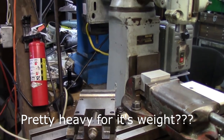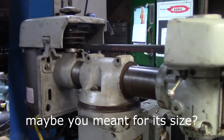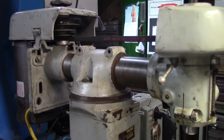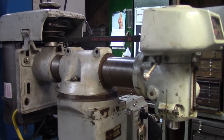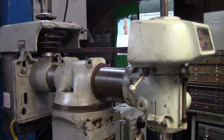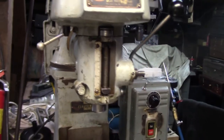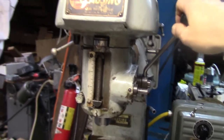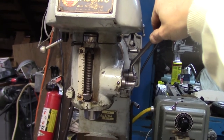It's pretty heavy for its size — this machine weighs about 700 pounds without the motor. The head and spindle are mounted on a round ram, which I try not to move too much because it's a pain to get the machine retrammed once you move it. It does give you a lot of flexibility though — you can move it in and out about eight inches, tilt it side to side, and swivel it.